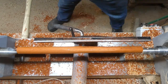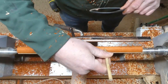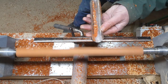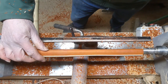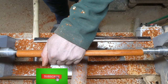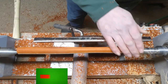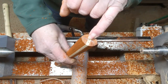And the other side — I still have got a bit of narrowing to do, because the shaft is narrow on both axes. So I need to narrow this down as well, which I'll do on these offset holes. I'll do this one first, just narrow that one down to that line I've just put on, get it nice and even and smooth, and then turn it onto the opposite one again and just narrow down that little bit on that side. And there you can see it's a nice sort of ergonomic shape.